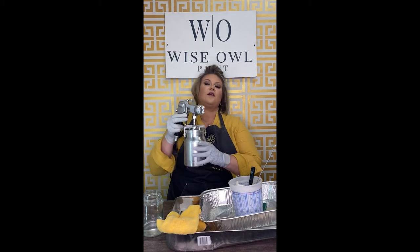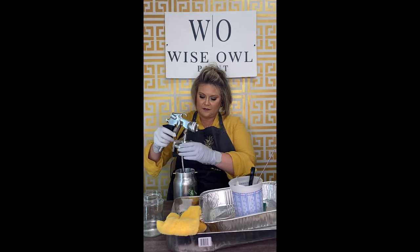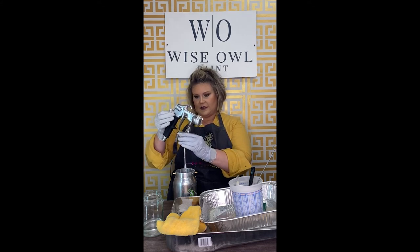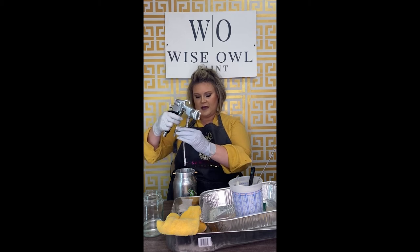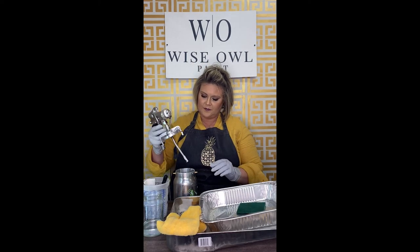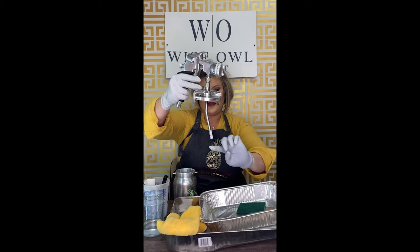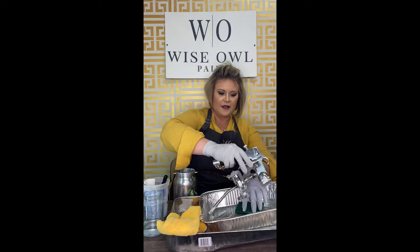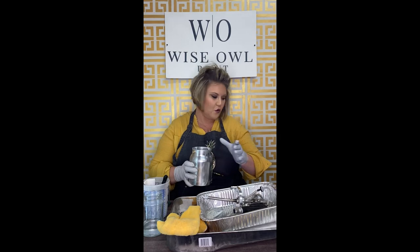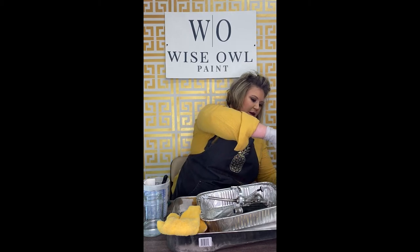Okay, yoke style pressure cup means you'll just pull this off, twist it, and you'll have some liquid come out the bottom. If you didn't spray it all out, I obviously didn't spray it all out. Pull the handle a couple times. Look at that. Very rare you'll see my gun. This is dried 1 hour enamel and bone on our nozzle. We'll go ahead and just place that down right now in our aluminum pan. I'm gonna dump out this extra water because I didn't want to take the time to spray it all out. But you will want to do that.